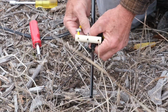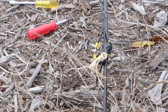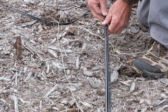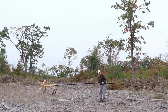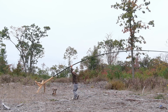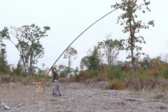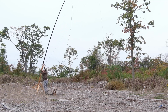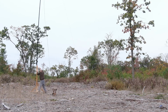I wanted to try 3 different antennas on this little trip to see how this mast would do. The first antenna is this tuned doublet. It's a wire of just 20 gauge speaker wire using a small section of PVC pipe for the center insulator, fed with 92 feet of lightweight 300 ohm twin lead. I thought I could not get lighter than that, and it worked fine in its installation.